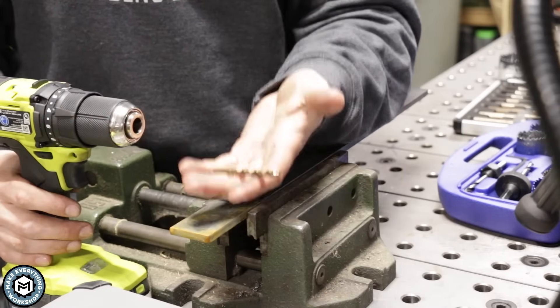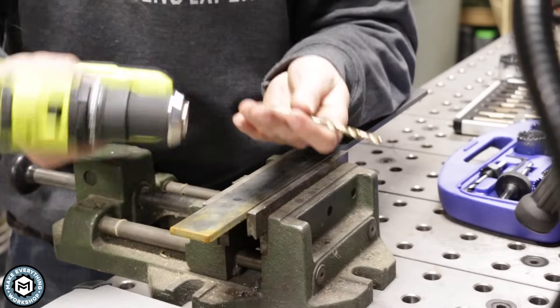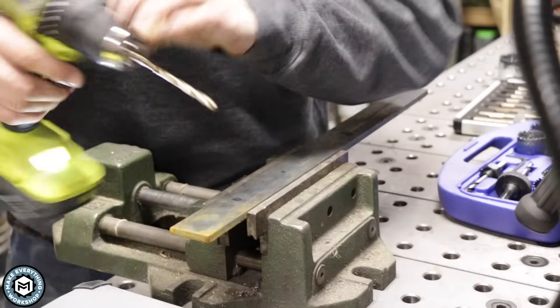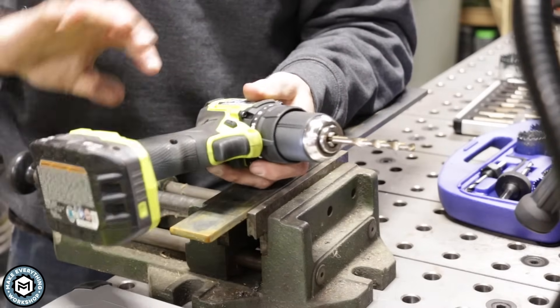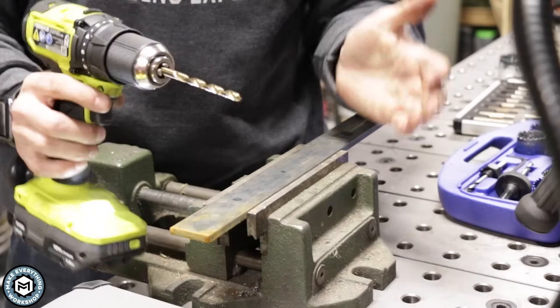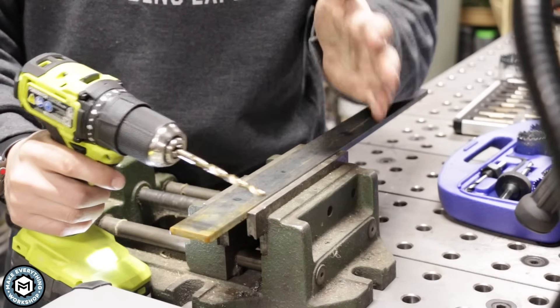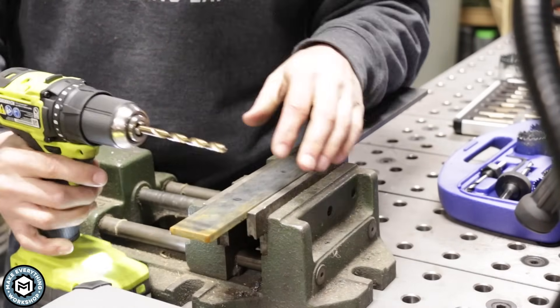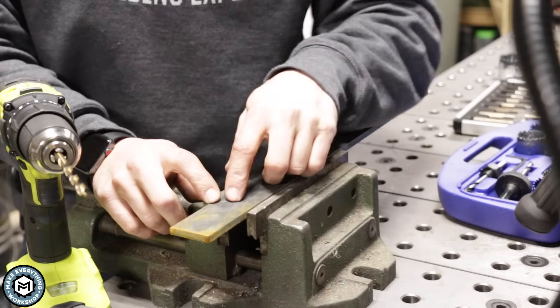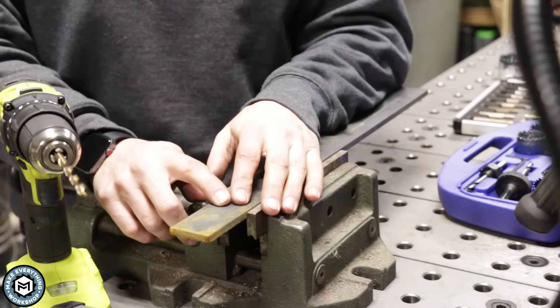Since I'm using an inexpensive drill bit, I'll use an inexpensive drill — this is a Ryobi 1 HP from their new performance line. They are a formidable piece of tooling in the shop and I actually really like them. One of the things when you're drilling steel is you always want to have a punch mark for your drill bit to register into.